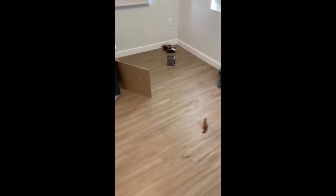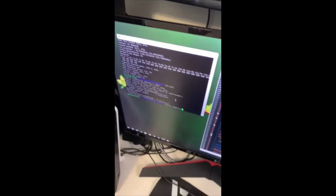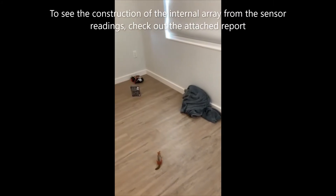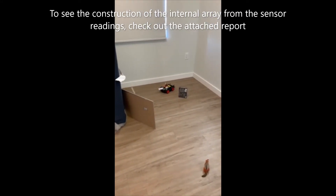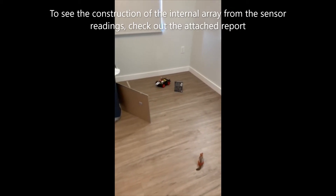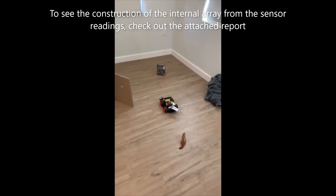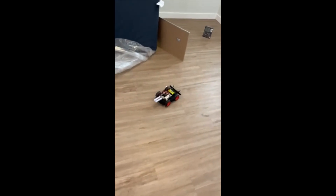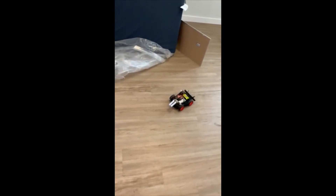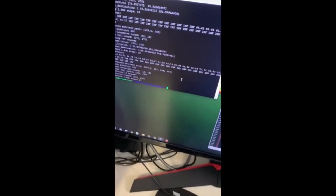Here is a quick demo of our self-driving car trying to get from one corner of the room to a sandal. We'll come to our SSH terminal and run the script. The reason it pauses after each move is because it's calculating the route and printing some graphs to the system for inspection later, which is important for our report. You can see it's turning appropriately — it never moves too far because the ultrasonic sensor range isn't that long. There you go — the script stopped, meaning it reached our destination.